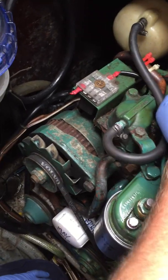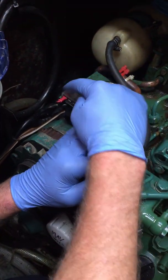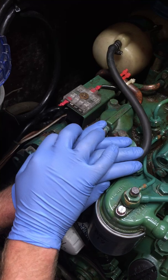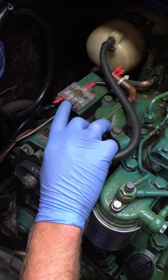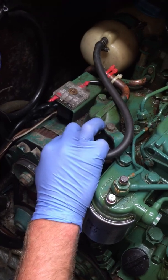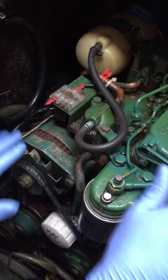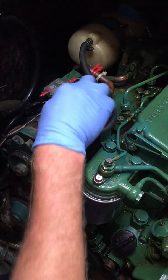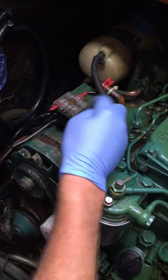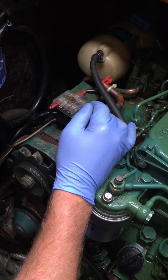We could perhaps get some spare fuses just in case. Well, this is a four-way fuse block, so if it did pop you can take your spade out and just move on to the next one. If you're ever stuck - the way you'd know is you turn the ignition on and have absolutely nothing, it cuts power to everything. It's got a little clear window so you can visually inspect whether it has popped, and if it has, unplug it and put it onto the next one.